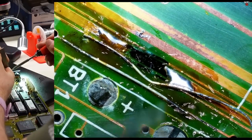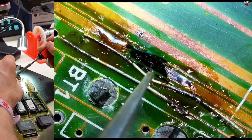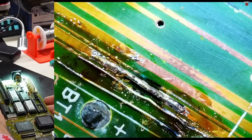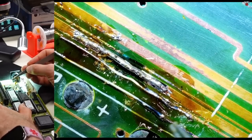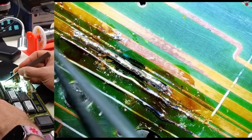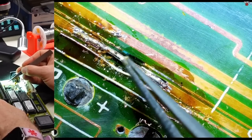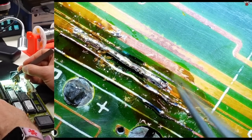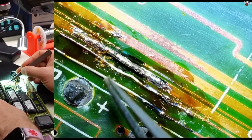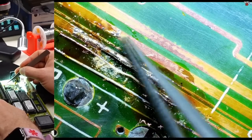This is kind of getting frustrating. It's pretty frustrating doing this kind of micro soldering. I really do recommend — if you don't want to go through all this heartache — that you figure out where the traces start and end on the bottom side of the board and just join it there. This thick trace almost certainly goes from the power connector to one of the slots, and you could just run a wire on the underside, not even deal with this whole section — just sand it off and call that good, because this is just a huge pain to work with.